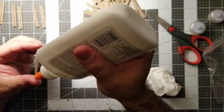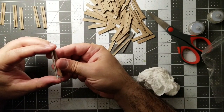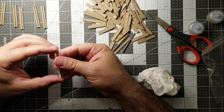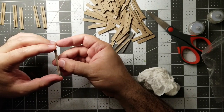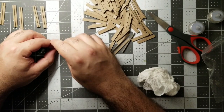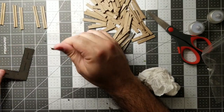All right. So this is a little out of sequence, but what I did before full assembly was attach that 1/8-inch strip to a 1/4-inch strip, and I just made a bunch of those channels. Now, you're going to need 2 for each door that you make so that it creates that buffer so that you can slide the door through it, and we'll see that later.